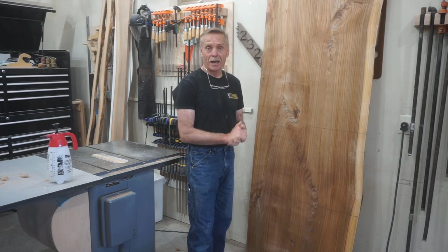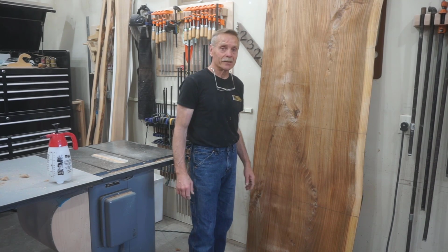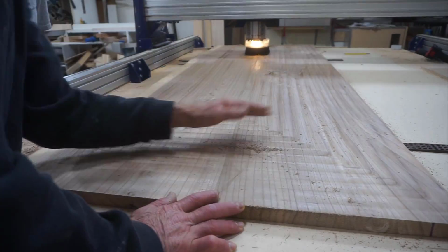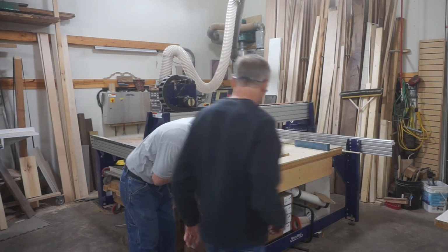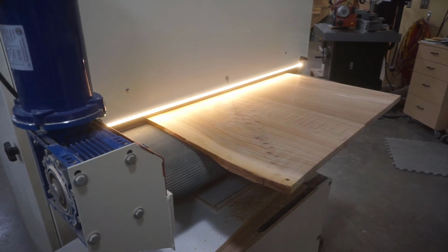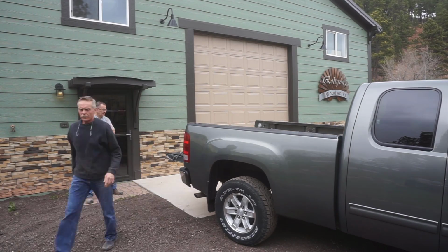Personally, I'm hoping that the designer and the customer agree with me that this will be mission accomplished for creating the live edge doors for that island cabinet. Considering that this is elm and it was a pretty fast growing tree, I'm really pleased that this panel came out as flat as it did. If this was something other than cabinet doors, with very tight tolerances, I might just finish this slab off with patience and a belt sander. But since it needs to be so flat and so true, I'm taking it to the shop of a very capable local cabinet maker where it will get flattened on a CNC and then thinned down and trued up on a wide belt thickness sander before I cut the panel into 4 sections for the doors.